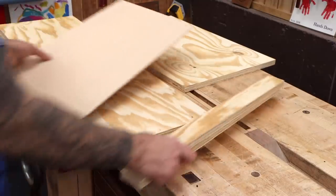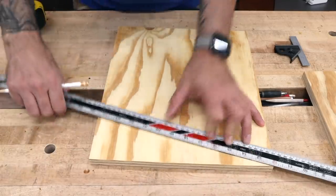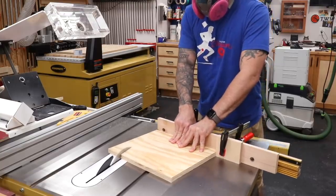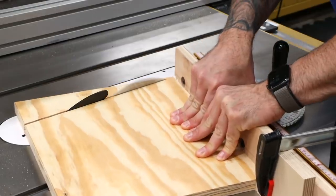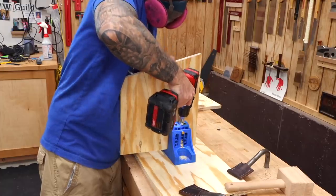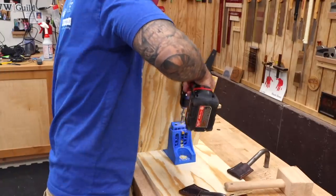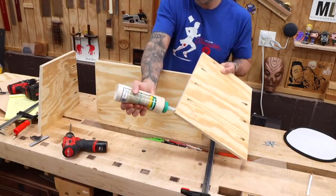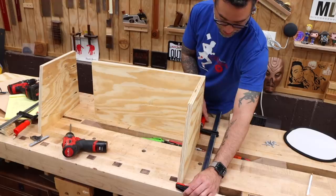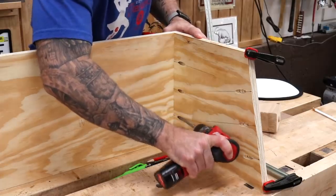And there's all the parts except for the door. The sides of our case are tapered, so I lay out the line and make the cut at the table saw. Now for the pocket screws — they're certainly strong enough for this application, but every joint will benefit from some waterproof glue. I can then secure the sides to the bottom.